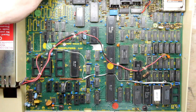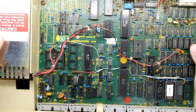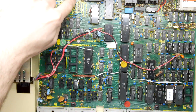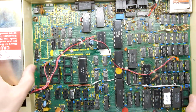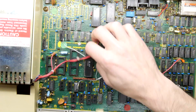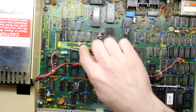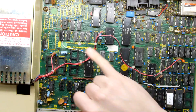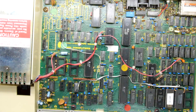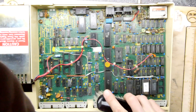On this side here, that's the two missing ports. So you have the Econet switch, and here is something marked on the motherboard as a reset switch — we could probably quite easily pop a reset switch back into that footprint if we wanted to. There's also another little bodge: there's a little capacitor on IC29, bodged in there. It's all a bit strange, but let's just give it a quick clean — a little brushy brush.